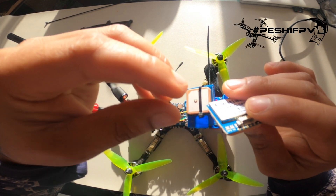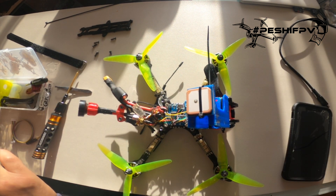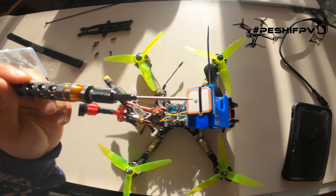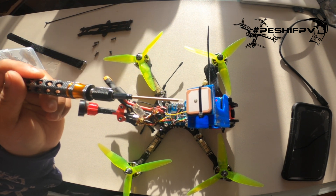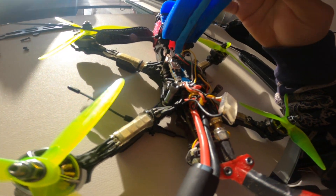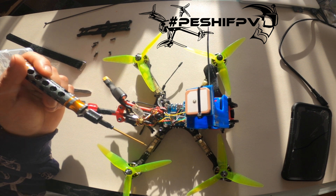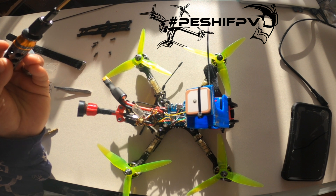This is another one I've got for another rig, so you can see the one I have fitted here. The antenna bit is this foil with the ceramic sheet over it, so that always needs to be facing the sky. I've got the cables running down the back of my GoPro mount — it's the highest spot, furthest away from interference. I can't put it on the arms because I've got LEDs on there.